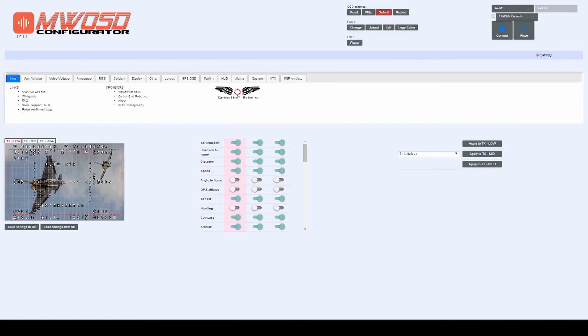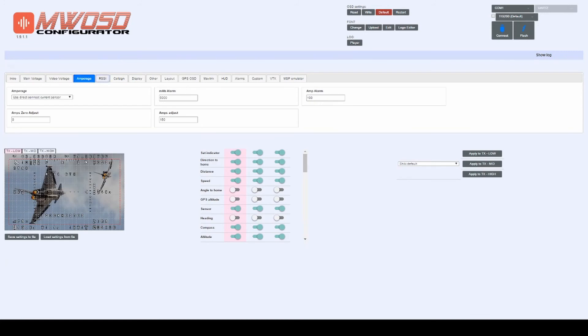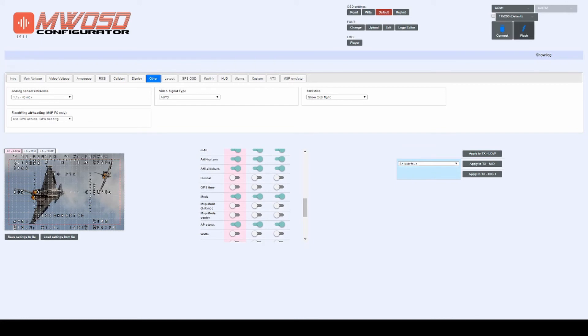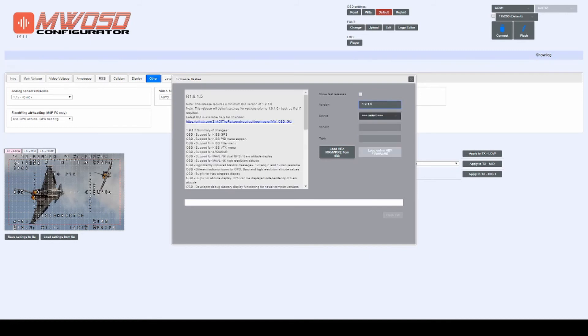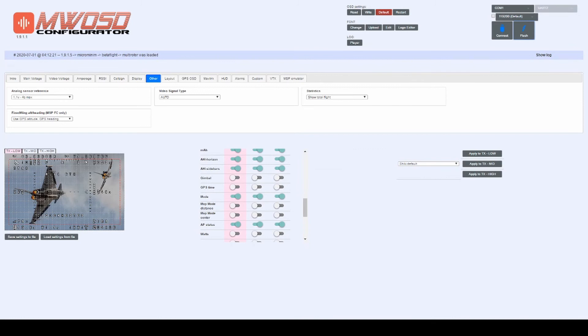In terms of finishing setting up, one thing I had to do is flash new firmware to the Minim OSD because it came with version 1.2 but needed 1.9, and it needed to be configured for Betaflight. It's pretty easy to do with the configurator — there are a lot of different settings in here so you can configure your board. You do need to pay for the software if you want to change the actual OSD settings, but to flash the firmware you just go up to flash, select the configuration you want, select the board you're flashing to, and set it to Betaflight if you're using Betaflight. Flashing is free — you don't need the paid version — however you will have a lot of stuff on your screen if you don't get the paid version to disable some of the elements.